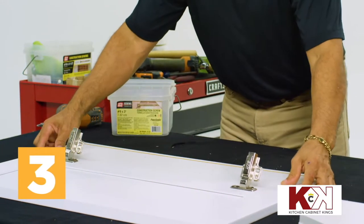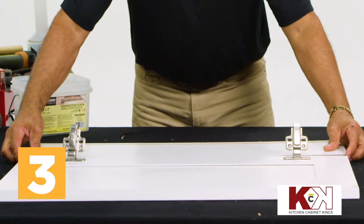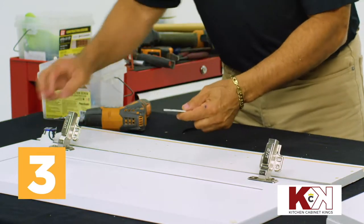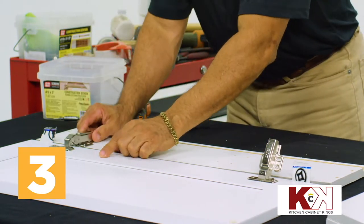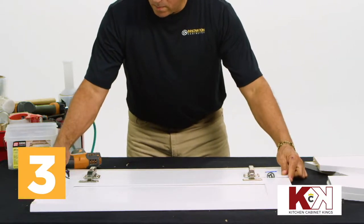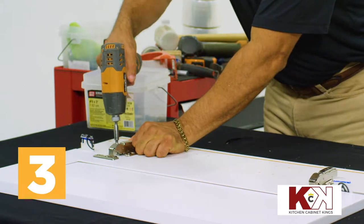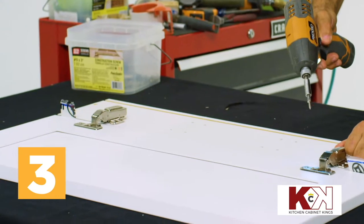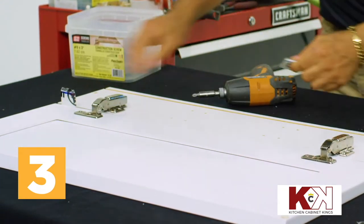Place the narrow side panel underneath the hinge side of the door and ensure the two pieces are even with one another. Check that the slot side of the narrow side panel is closest to you, as the hinges will attach to the side of the narrow side panel without the slot. You can use a separator roughly the thickness of two credit cards to ensure a slight gap between the two pieces. Set the hinges so they are flush with the narrow side panel, then fix the hinges to the panel using a drill and prepackaged screws.